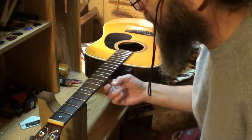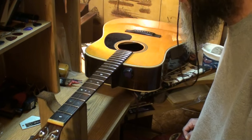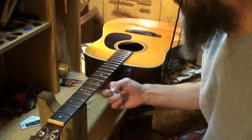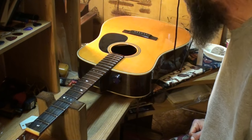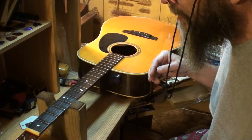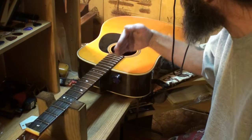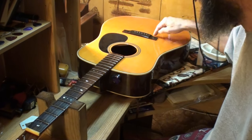It filled those grains, it cleaned the fretboard — it looks much better. Looks a lot better since I polished the frets too; they were tarnished terribly. That's the way I do it folks. Put it on, wait three to five minutes, rub it off — rub across the grain, not with it. And oil your bridge — always oil your bridge if it's rosewood or ebony.